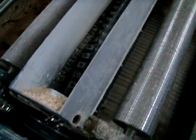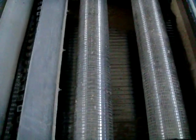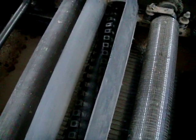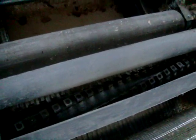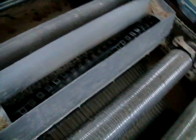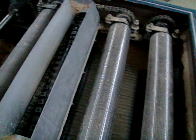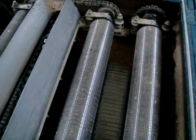The planer has a 7kW motor, and there's about a 5kW engine somewhere down there in the bottom — it's a fairly big one. I just didn't want to undersize it and have it getting stuck. I'm actually using the whole length of the cutter head because I'm doing edge-glued panels. Once I take them out of the press, I just run them through this machine and the sander has almost nothing left to do.